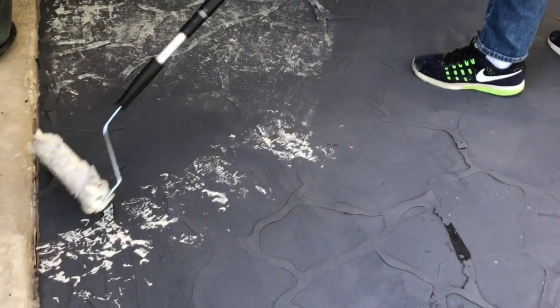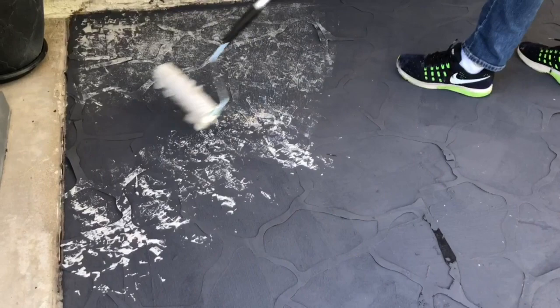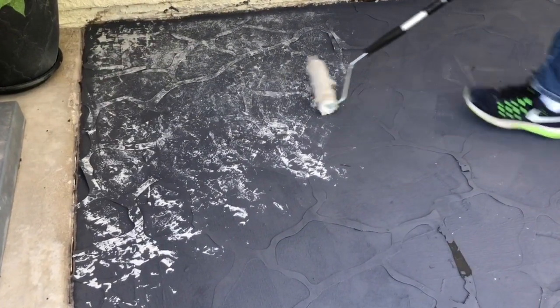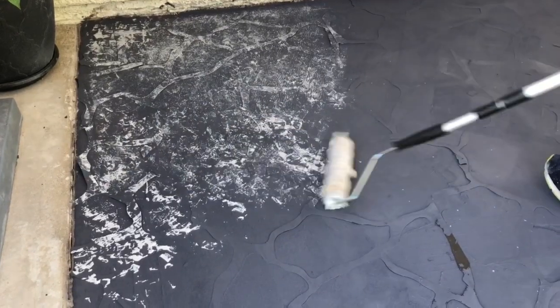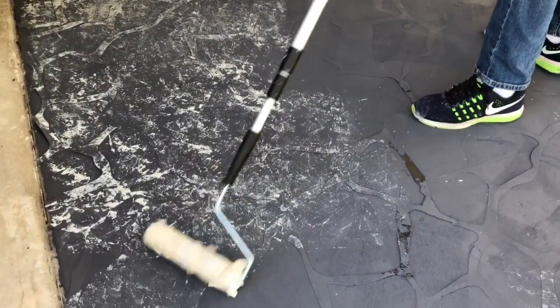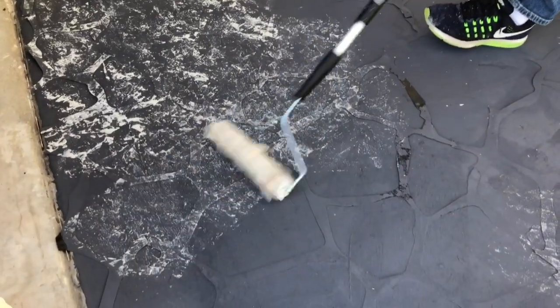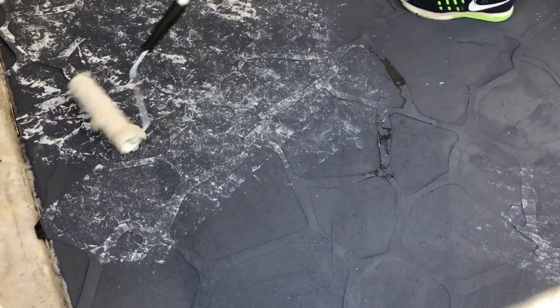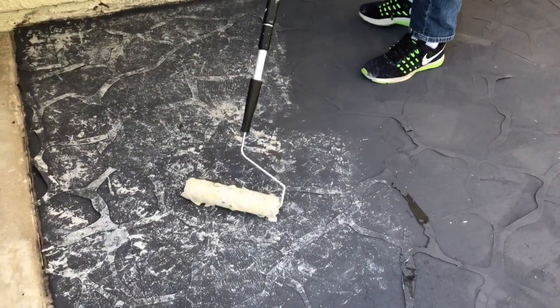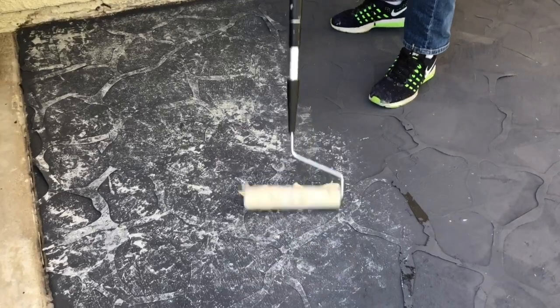With a lighter touch, it's easy to add more accent here and there where you may need it, giving you complete control. Once most of the loose wet material is off the roller, you can roll freely in both directions and use more roller pressure. Now we are flattening and blending the accent into the surface. Don't worry about the flaps being flattened down against the roller like this as you work. It is a natural part of the way the roller adds visual interest to the surface and also helps lock everything together.